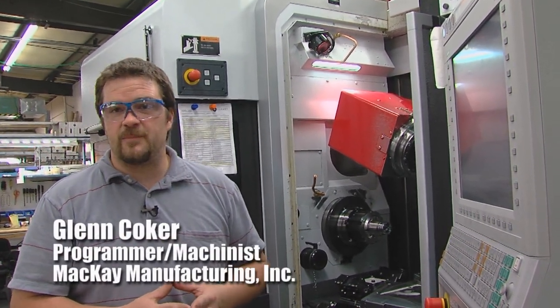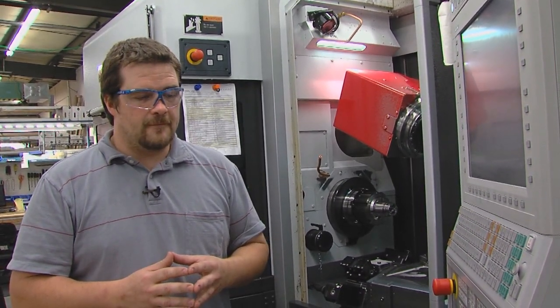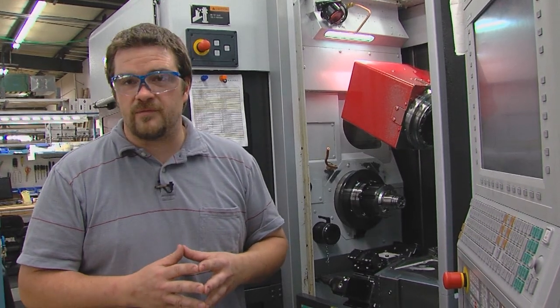The first thing we're going to demonstrate is high-speed pec tapping. We're using a 6-32 tap to tap 455 stainless, and we have to pec tap because it's about four times diameter — it'll just break taps and cause all kinds of trouble if you don't. We used to do this in seven ops; now it's two. The spindle time is relatively the same — about an hour total — but we're reducing six setups, and setups is where all your time is: hours and hours of setup.